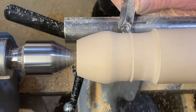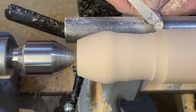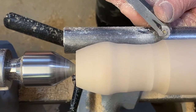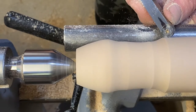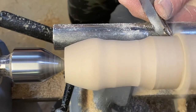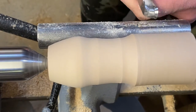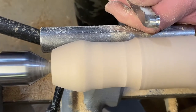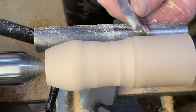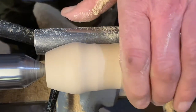Each time I come in I have to start with the cut round at the front — handle in front of the cutter, not behind. With a standard cutter I'd come in with handle behind, get on the bevel and ride it. The difference is bevel angle: the AU cutter has probably between five and ten degrees of bevel, whereas a standard cutter has a thirty-degree bevel. That's why with the standard you can start the cut from this position, but not with the AU.